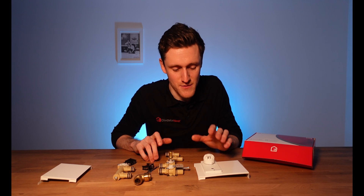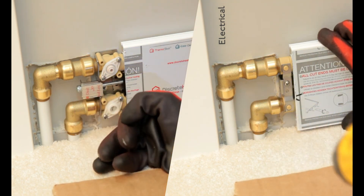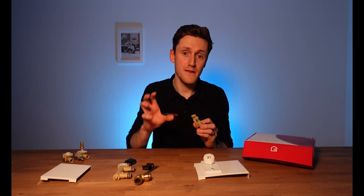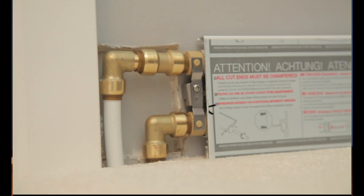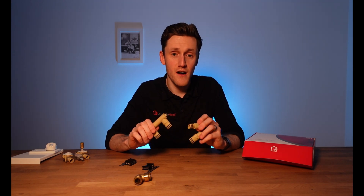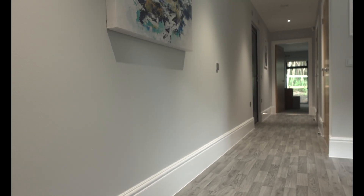If you want your control system to be completely invisible and you don't want a knob on your thermoskirt system, then you'll go for a non-TRV feed and return kit. That's the same setup effectively, but rather than a lock shield and a TRV valve you have two oval to 15mm or oval to 16mm fittings that connect directly from standard pipework into the thermoskirt. There's no knob on the skirting — instead you'll have a standard blank cover plate. This is the most discreet option. The feed and return kit is the most necessary kit of all, because you can't connect from standard pipework onto a thermoskirt system without it, whether you're doing a huge open plan room or a simple one-strip hallway.